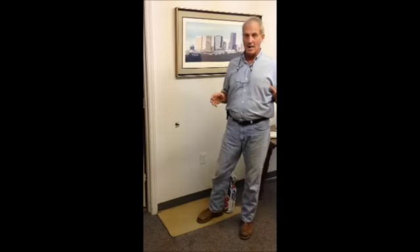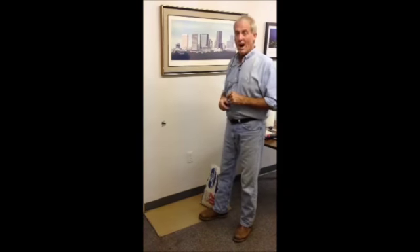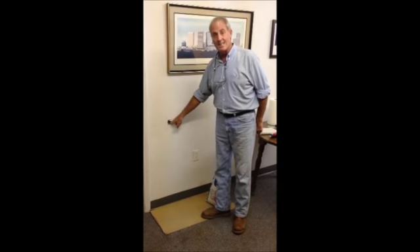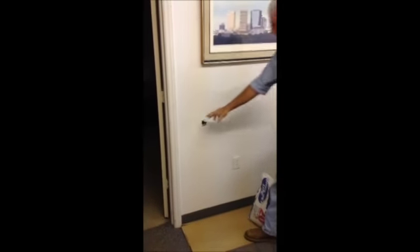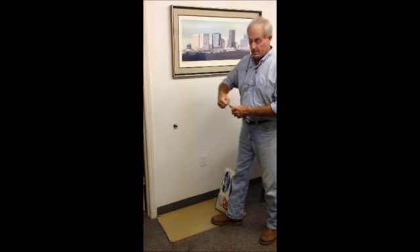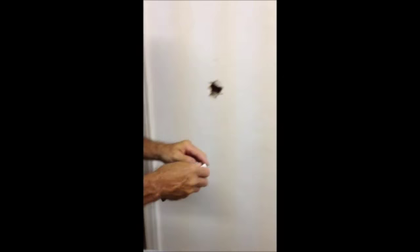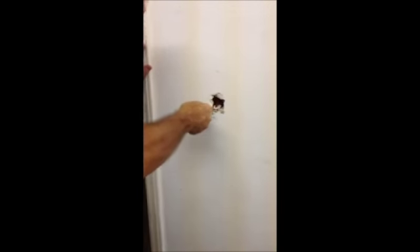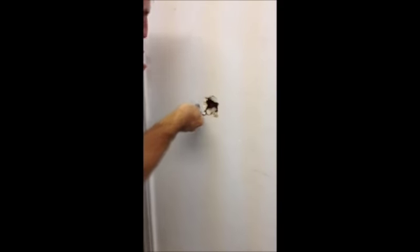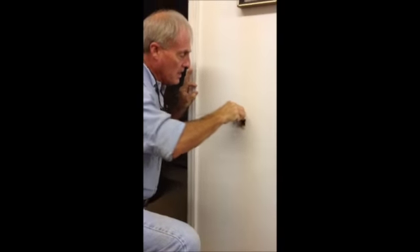Hey, Terry here — I've been doing construction and remodeling for over 40 years in the Shelton, North Carolina area, and I've fixed quite a lot of drywall holes, imperfections, and problems in drywall. We're going to shoot a small video and show you how to fix a hole like this in your wall. That's the standard hole — I frankly don't know how it got that way, but I'm going to make it a square hole using my Leatherman and its little saw blade, and then we'll make it square. It's easier to repair if it's square.